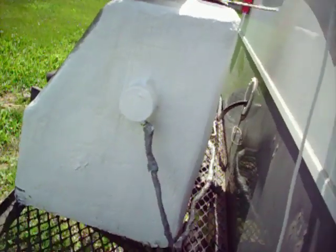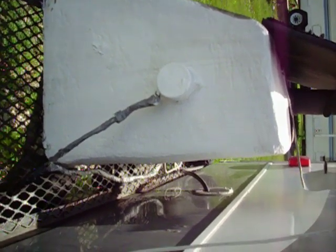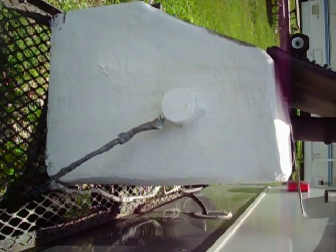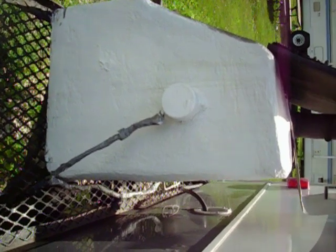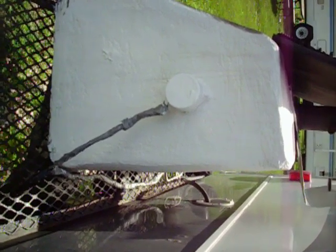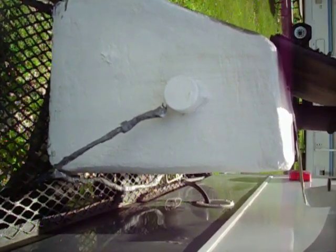On this side, you've got a thermostat rheostat. Costs about $20. And all that does is it turns the blower fan on as the temperature goes up. You want to use this for when you're barbecuing in the summer and you're not heating your fifth wheel, but it makes it pretty efficient in the wintertime. It kicks on, and usually the stove will run about 4 to 5 hours before you have to stoke it again. Now, there's about 6 inches of clearance between this and the back of our RV. We haven't had any problems after 3 years.